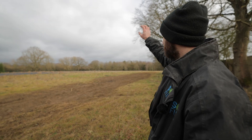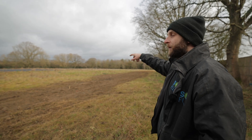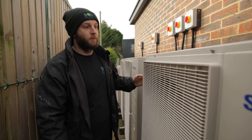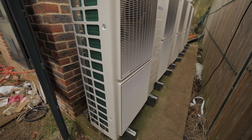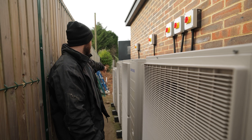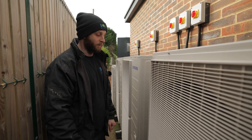The plan is to have one array down at the bottom — out of sight, out of mind — and then because this roof over here has been redone, we're going to have a nice split east-west system up on there. One of the reasons the supply is so large is the heating and hot water is being handled by three heat pumps, and there are also two AC units — each one of those is 32 amps, plus another couple of 32-amp units — so this is one of the reasons why the supply needs to be so large.